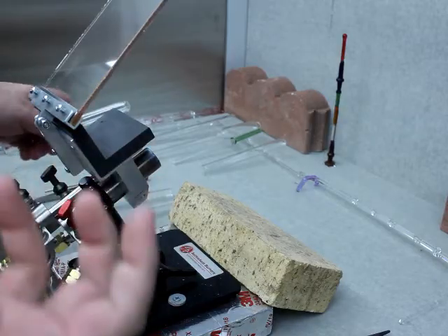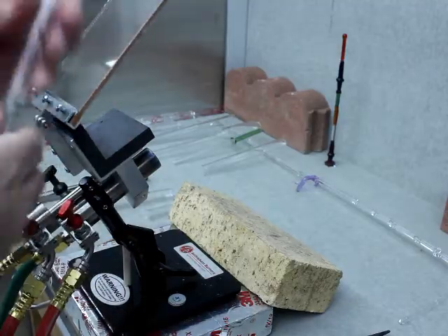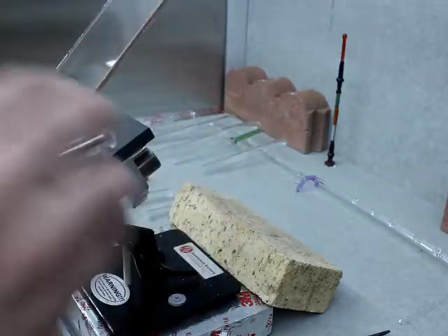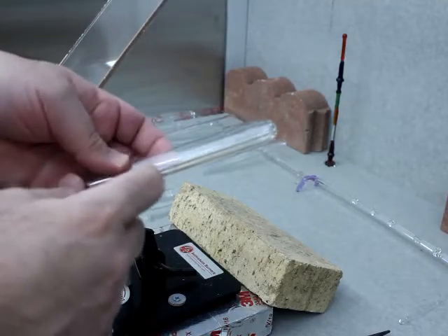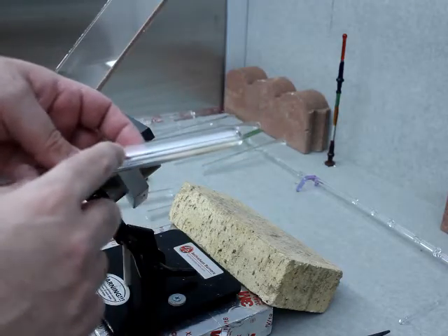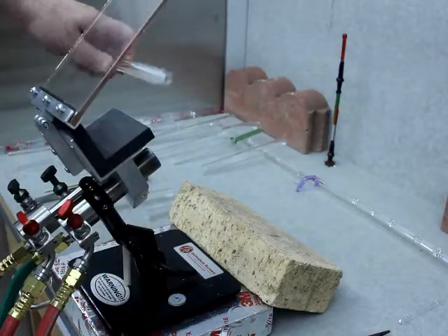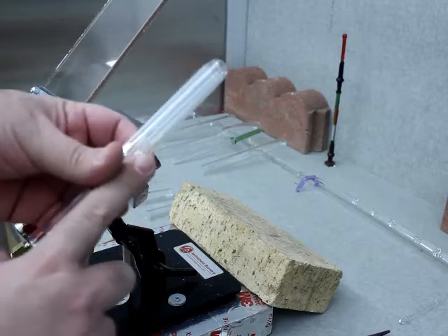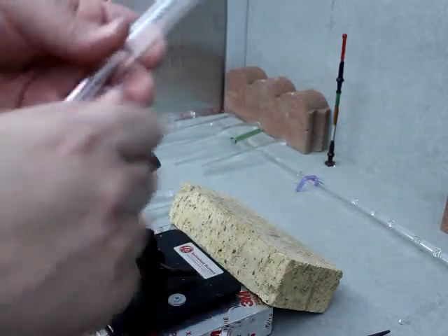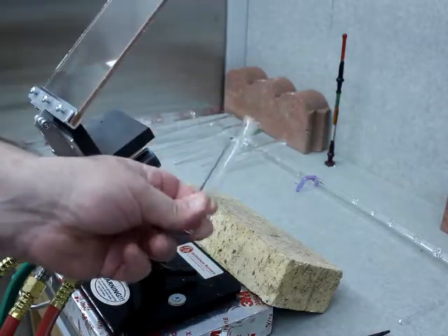Making a ring seal if you don't have a lot of experience — the way you can cheat, as it were, is by preparation. With this jig, the purpose of this whole setup is to make it as easy as possible for me to make the ring seal. If I don't have that tube basically under control and aligned as I make the ring seal, it flops all over the place and it starts to become a huge headache. If you've got cardboard stuck up in here, putting it in and taking it out can also be a pain, especially with more narrow diameter tubing.